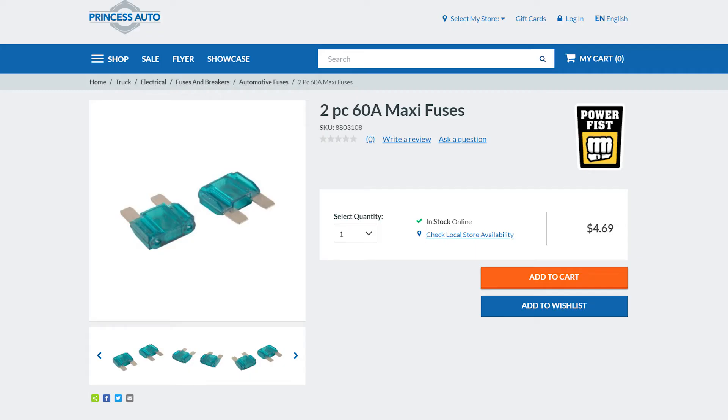We used this unit for three months and never had a problem with it, other than the first time it actually overheated — which was caused because we had purchased some pretty poor fuses from Princess Auto. We had a fuse bust on us even though it was sized correctly, simply because there was too much resistance in the line and the fuse overheated. That was after two days of use.